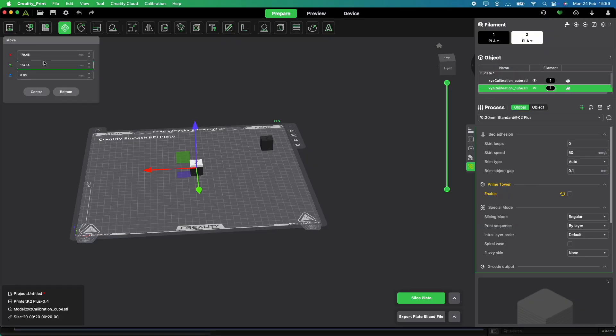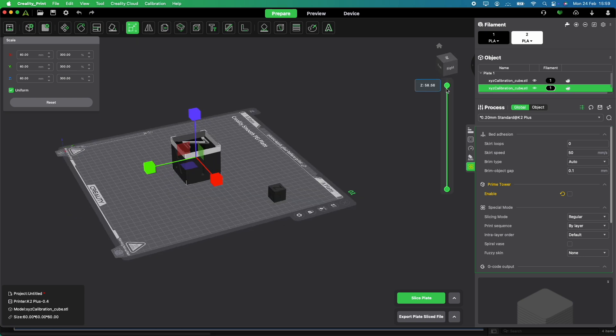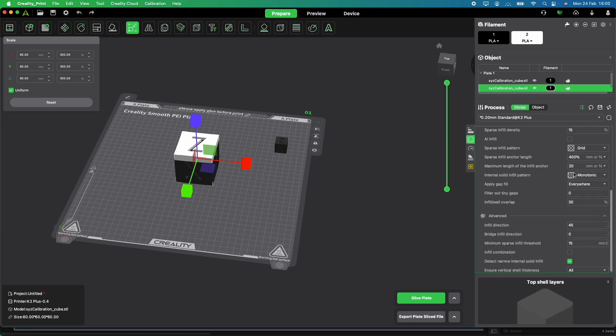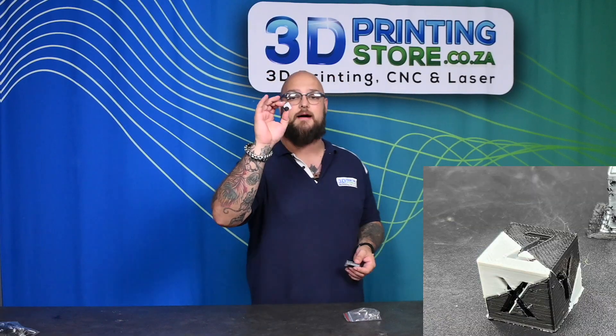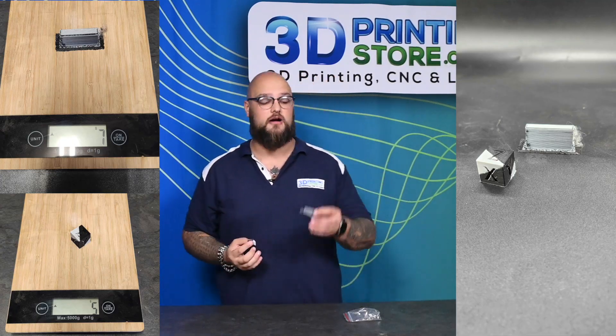The advantage to this type of purging is that you can actually put it inside of your print. Obviously, with a larger print it's going to be more successful because larger infills means more purging — more filament going out until you get to the outside of your print. For this case we'll stick with our 20 by 20 cube. Inserting our filament flush into the cube did actually brighten that grey up.